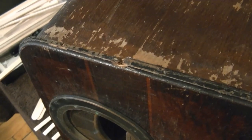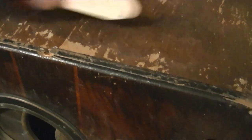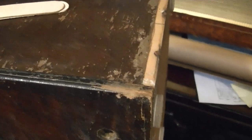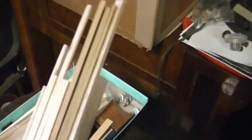But there are sections that are missing. I remembered a good tip from when I was working on a similar Philco radio a few months ago — popsicle sticks, which are made of pretty good wood, I think it's white birch, and they're just about perfect dimensions for the sections of this old plywood. Balsa wood is fairly useless — it's just way too light, like styrofoam — but basswood is decent enough for trim.